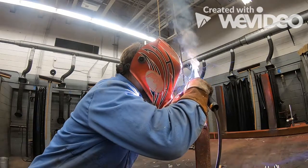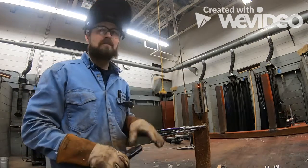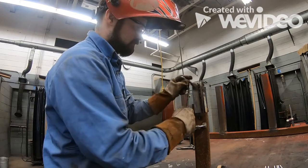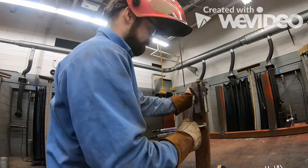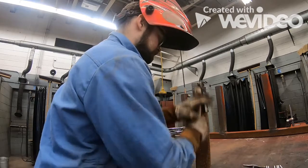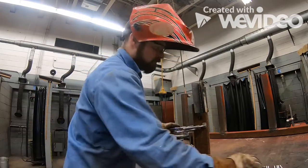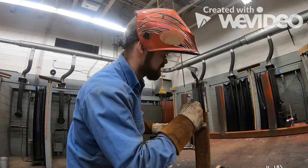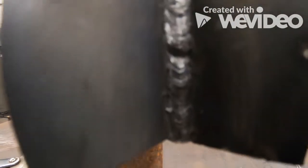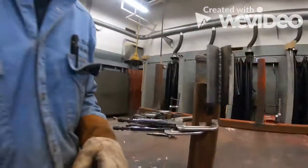When you get to the top, push over that edge — don't stop right at the top, keep pushing over. Give it a second to cool down. Remember, the cleaner the weld the better off you'll be. Always double-check and make sure there's no slag at the edges. Here's our initial pass — good tie-ins on the toes, nice and even across both sides. That's what you want.